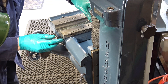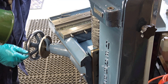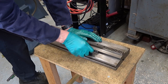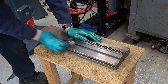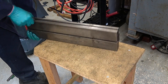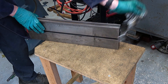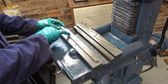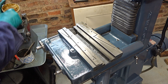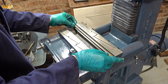There are five gib adjustment screws. They're a bit fiddly to get in so I'll push them in and sort them out off camera. This table's pretty heavy. Fitting the table gib: the holes for the adjusters are drilled in at an angle, so if you're careful you get it the right way up. I'll put a bit of grease on it to hold it in place. Getting this table off was quite difficult previously — it was very jammed; it may just have been all the rubbish that was in there.